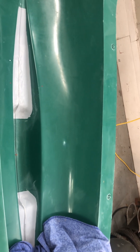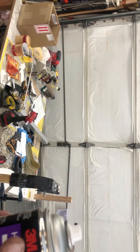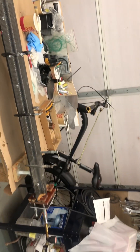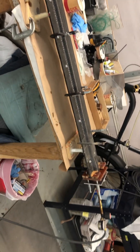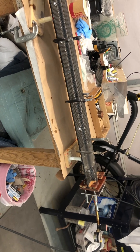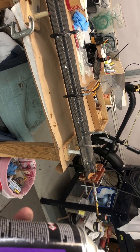DuPont U-428 is basically a windshield adhesive — carbon to carbon. You can find it on eBay for about ten dollars a pop; it's good stuff. That's what the interior parts of the yellow velomobile you've seen me build are put in with. The spray adhesive is a lifesaver — I laid one up one time just putting in each layer and wetting it out, and it was a mess with a hundred gloves. Now I just load all the carbon, soak it down, turn it on, and let it run out into a bucket.